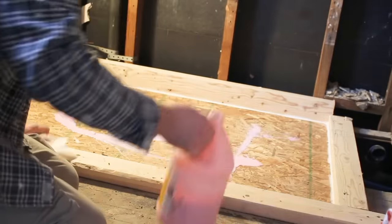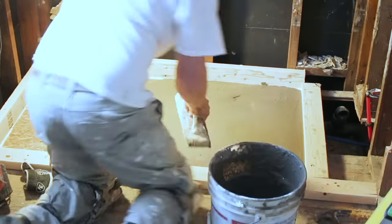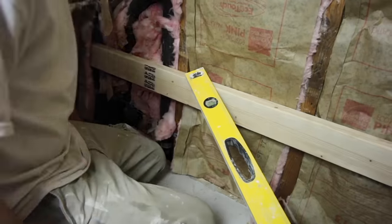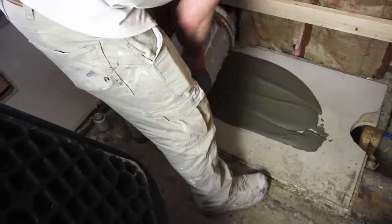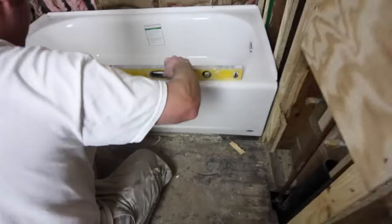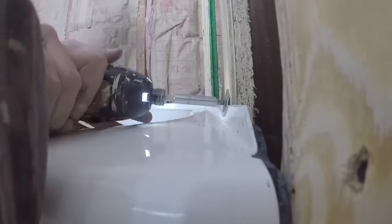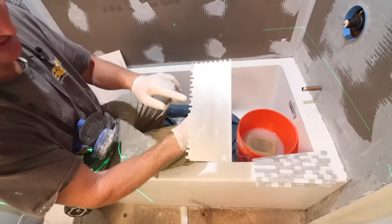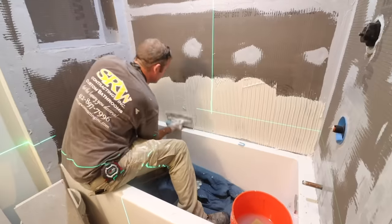This primer was used over top of a wood subfloor so that our self-leveler would stick to it. Oftentimes the area right where the tub goes is not level, so you can add a self-leveler, then add a stringer if your instructions call for that — just make sure the stringer is nice and level. In this case we added mortar over top of our tub area and set our tub in that, making sure it was level on all four sides. Always make sure that you secure a steel tub or cast iron tub to your studs. A Euro notch trowel was used to apply modified thinset to the Wedi building panels along the short side of the tile.